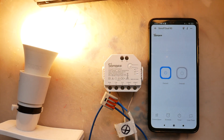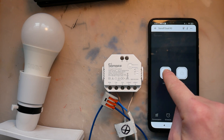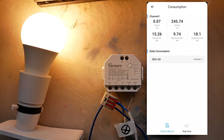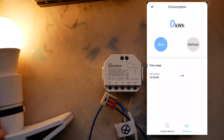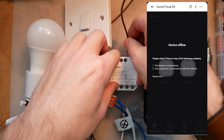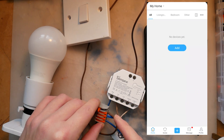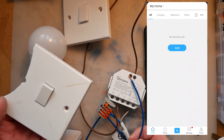As before, it's responsive and you can control it from the internet and the switch itself. Now, to add the switch we're gonna complicate it a little bit more. But first, since I've got this connected, we can investigate the consumption panel in the Ewelink app. Power consumption details are split between channels, which is great because you can monitor them independently. You've got a lovely chart and the ability to provide real-time consumption by measuring a start and stop point. That value is going to be zero here because it's an LED lamp and I'm only running it for a couple of seconds.